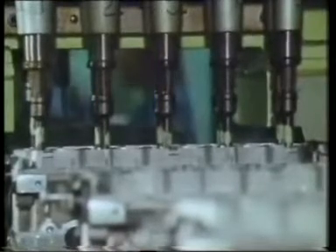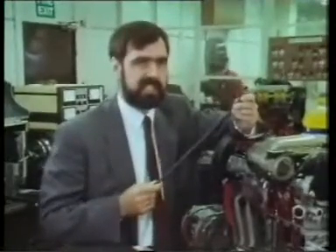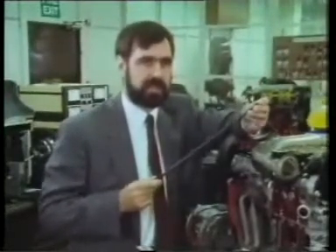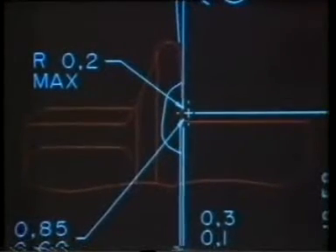That's where we come to a rather unusual area of this bolt's performance, in that that tightening will have taken the bolt near to yield. It's more usual for cylinder head bolts to tighten them straight into yield. But with this very long bolt and the aluminium engine, what we have done is taken it near to yield, and then the first time the engine warms up, the different expansion of the aluminium and the bolt stretches the bolt by nearly another millimetre — and that's what takes it into yield. The clever design makes sure that the clamping load is consistent.